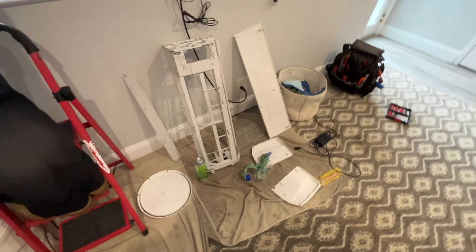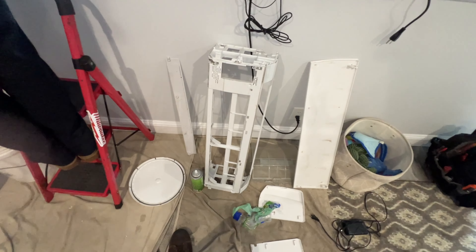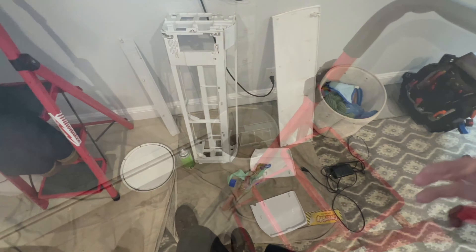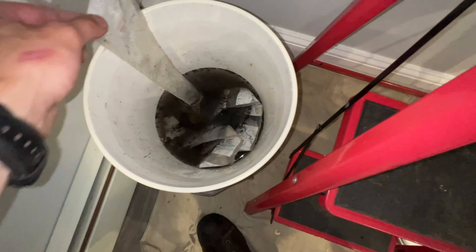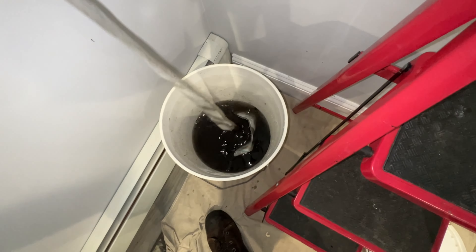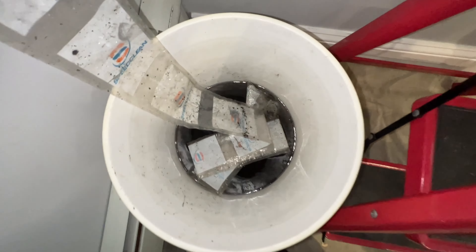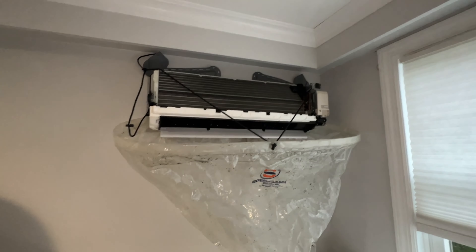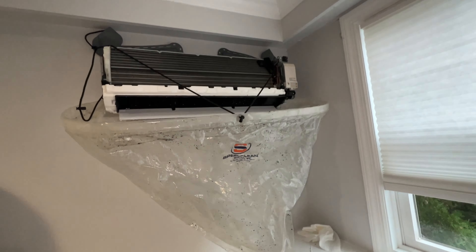For these components I'm going to bring them outside — it's raining, so I'll let the rain hit them. I'll spray them with some cleaner but they're really not too dirty, just dusty. Take a look at just how dirty all that water we pulled out is — that is all the crud sitting in these mini-split systems that so many people don't even realize is there. It really hurts the performance because it reduces airflow and reduces the ability to pull heat out of the air when the coil is dirty.